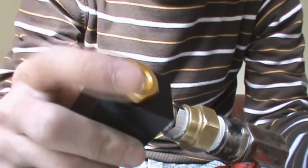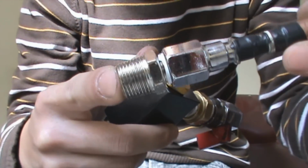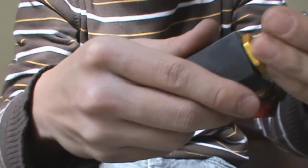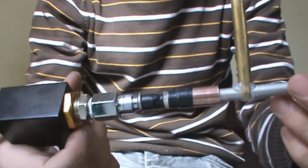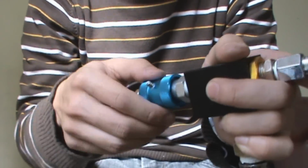Once you are finished, you should find out the exhaust port size of your QEV and put a standard fitting on it so you can connect to your QEV. So, it's ready. You now have a semi-automatic airgun. Now let's see if it works.